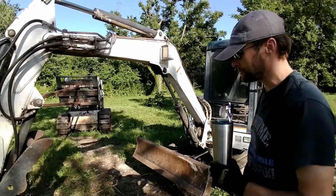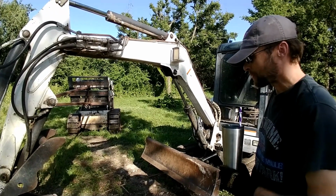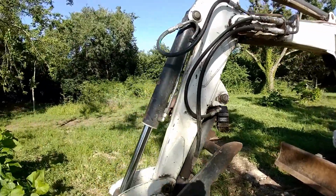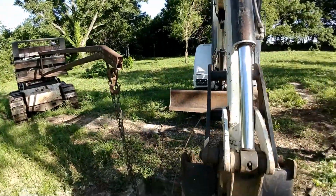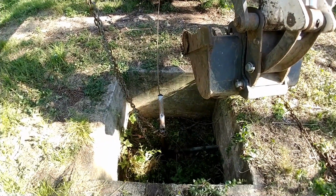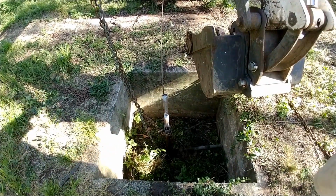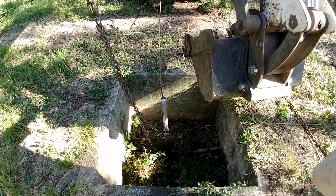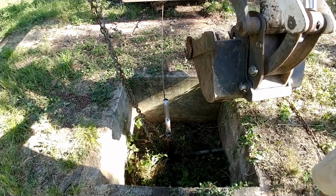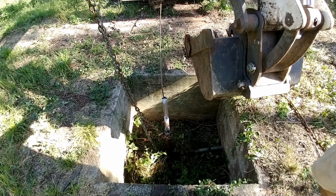What are we doing now? Not going very well. No, it's not. Not quite sure what we're going to do. Got some pipe out, then it broke. We pinched it. It's not going back in, so that's good. And Tim is thinking there's a boot or something holding it in place at the very bottom, scraping against the walls because that pipe is so deteriorated it can't come up smoothly. That's the only thing I can think of.